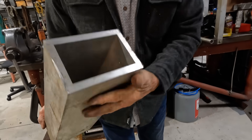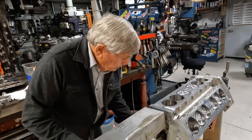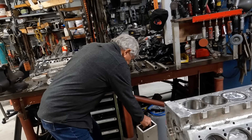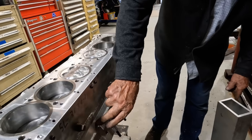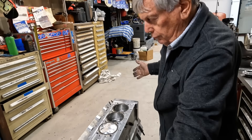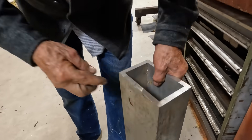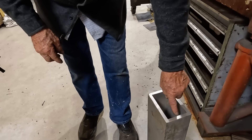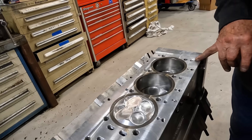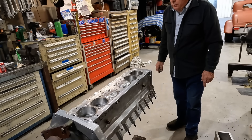This piece of half-inch wall, four-by-six steel tubing is actually the main block section right there. Kevin made that crankcase — the 'doghouse' shape, it's literally shaped like this, just long, and then they welded the ends on it and welded the tubing to the ends. Then you bore the holes and put the sleeves in. They put little bridge stiffeners in there for the head bolts.